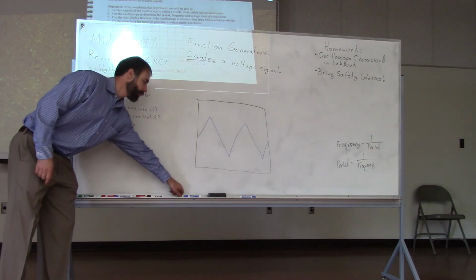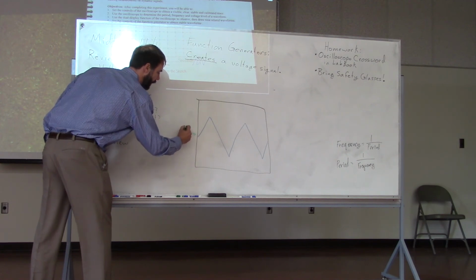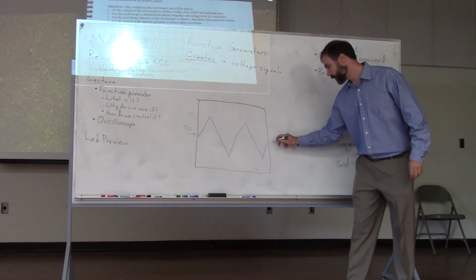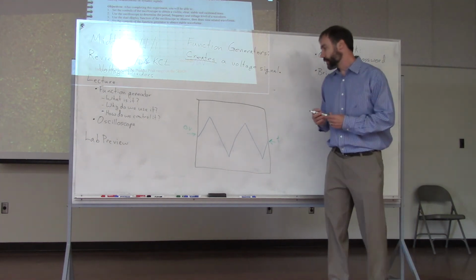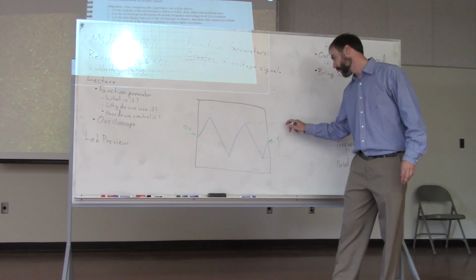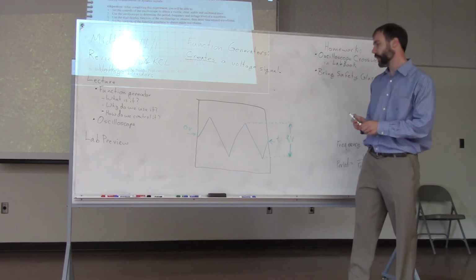You would make indications for the 0 level and the trigger level. So you would do something like this. You would draw a little arrow there, and you would say 0 volts for the 0 level. You could draw a little arrow on the right-hand side like this for the trigger. You could indicate that with a T maybe. It says to indicate the peak-to-peak voltage. So you could do something like this. Say that we wanted it to be 8 volts peak-to-peak. You would write 8 volts from the top to the bottom.